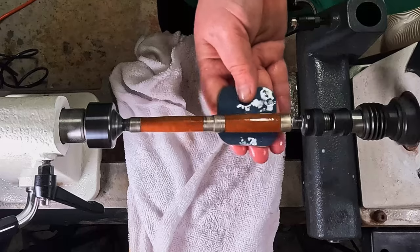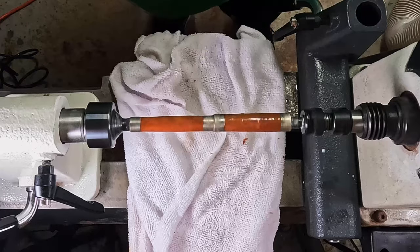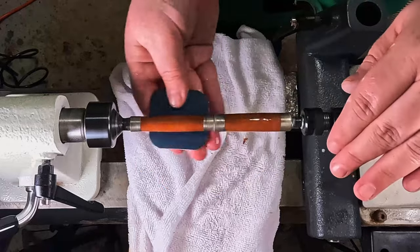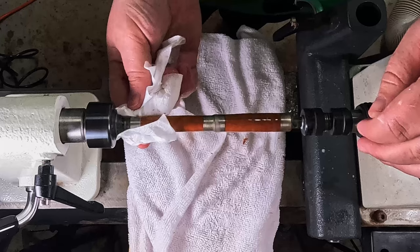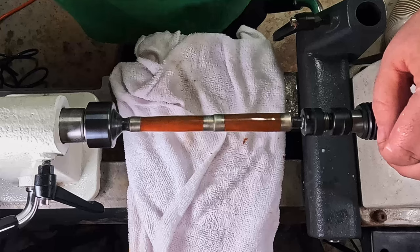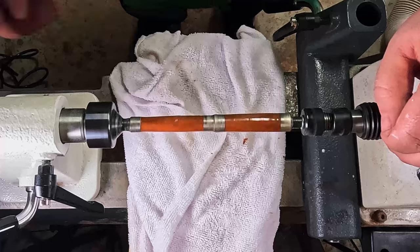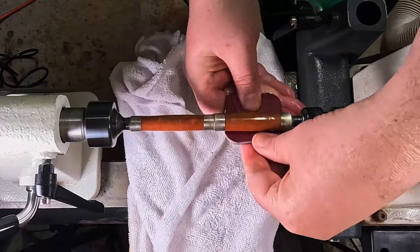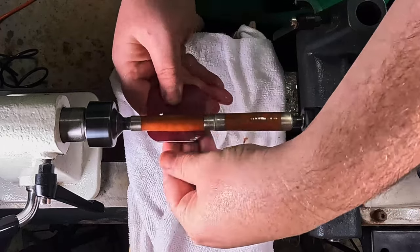There we go from the blue, and then we go to the pink. The pink is the final layer of the Micro Mesh system. Then I will stop the machine and give it a quick hand turn. Using some paper towel just to remove any additional moisture, I'll add another quick layer of moisture. As you can see, it's beading all around there, so it's actually quite smooth already — it wouldn't bead like that if it still had the ridges.